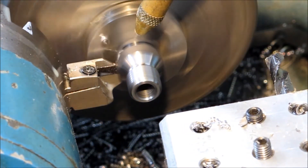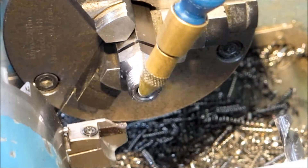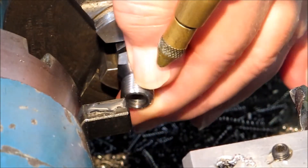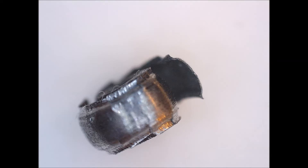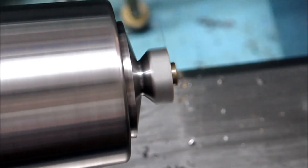There's the parting tool — works so well. This is running in the subroutine, so it just keeps repeating. That's the finish I was getting from the parting tool. You can see there's a few marks where it's getting under the hex. That's a chip from the parting tool — lost one of those, fell into my keyboard, had to go find another one. See the shape of the chip on the right hand side — that's making the chip less than the width of the groove that the insert is creating, so they tend not to jam up.